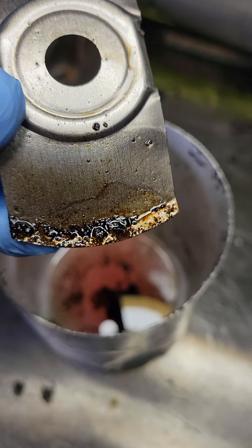The filter is doing its job by keeping debris in it, but it's located just a couple feet from the burner — so it isn't catching all the debris at the tank and it's clogging up that 3/8" line. The flow was just barely trickling out as I was trying to fill the new filter.